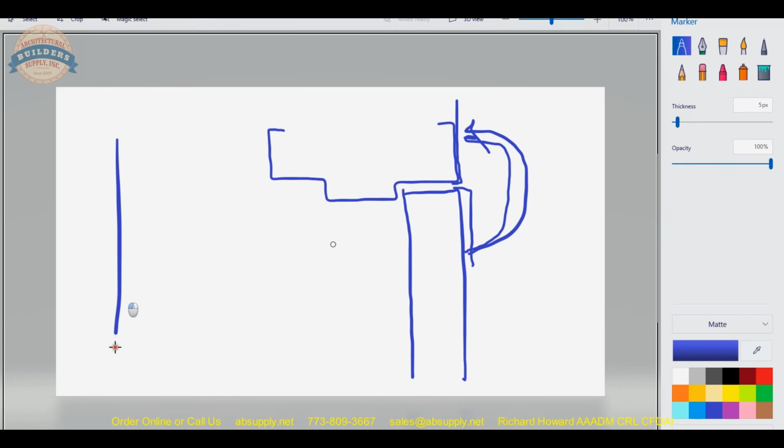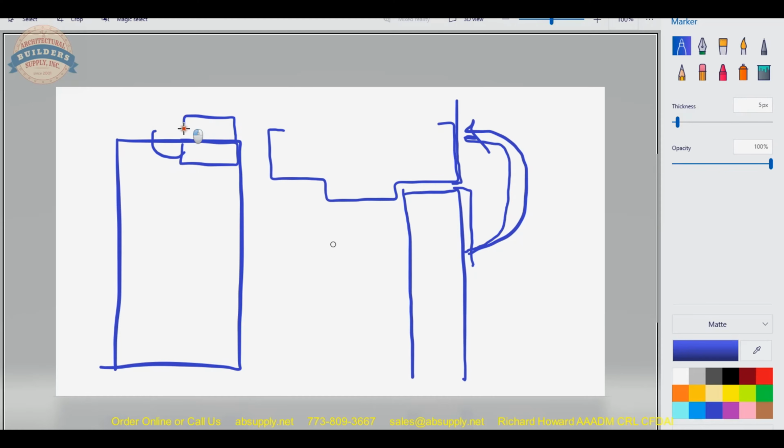Also, maybe in elevation, template here, take it, flip it up so that it looks like this. The point is that, if you get my meaning, the bent over ends are always working within the distance or the area between the header and the top of the door. So at that point, if you observe that rule, there's no other way to do it, meaning you're not going to hang it off of here and then hang it down on the header. Okay, hopefully that serves to clarify that.